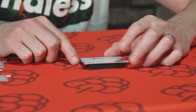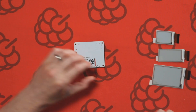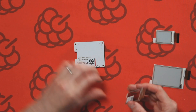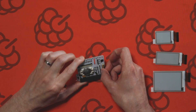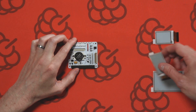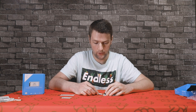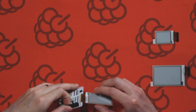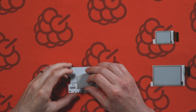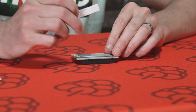The screen slots onto this connector and is then placed on top of the board. To connect it, you need to open the lever — pull it up and it should pop up. Take the screen you want with the ribbon connector and just slot it in. Once you've pushed it in — don't push too hard — close the lever and you should hear it click into place. Once it's in place you can flip the board over and place the display on top of the hat. There are also some sticky pads to keep the display stuck to the board.